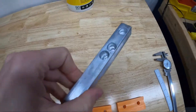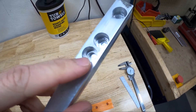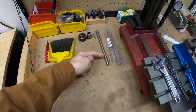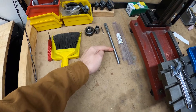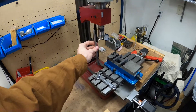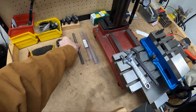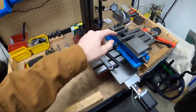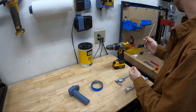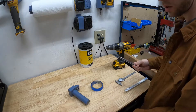This is the last hole I cut — I hit it with the ream and it worked pretty good, but I think I'm actually going to do some shortening on the reamer because I don't have enough Z-axis on my CNC. I need to cut it so I can get it in there and still have room for the workpiece. I think three inches is what I need to cut off.